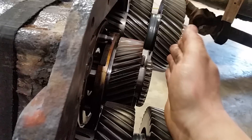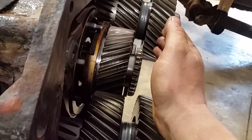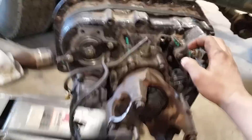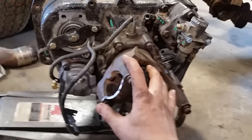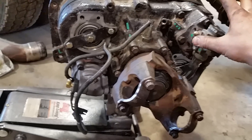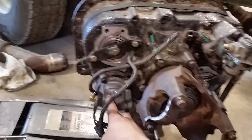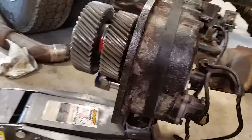The reduction gear in here is for gears one through four. These gears here are for five through eight. These gears here are for five through eight high, which is your top five gears. When you spin it around to the backside you have counter shaft, counter shaft yoke, speed sensors, speed sensor housing, rail housing, and your high-low housing and valve.